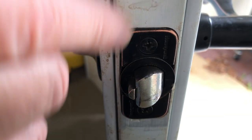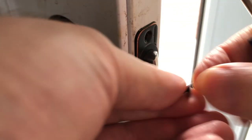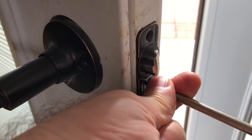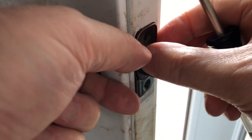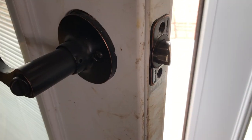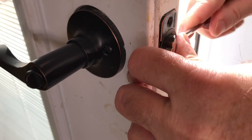There are two parts here: the face plate and the strike plate. The face plate swings up against the strike plate, and the issue is that the face plate wasn't set into the door properly — you can see it's sticking up just about an eighth of an inch high. When the door closes it hits the strike plate, so there's just a little hesitancy. The door shuts, but it really shouldn't have that ridge you have to work past.